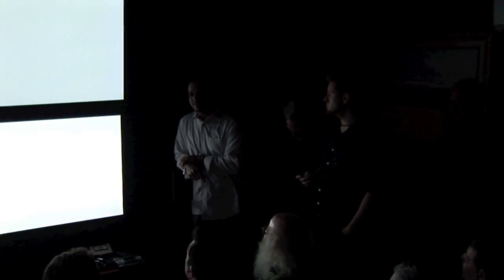Yeah. That's just one of the things with plasma. It has an issue. Well, it's not really an issue. It's a feature, by design. Yeah, it's a different issue from burn-in. Image retention is not burn-in. However, image retention can lead to burn-in over a very long time of the same image, and we're not talking about hours, we're talking about weeks, literally. In the early days of plasma, it was much, much more of a problem. It's no longer an issue.